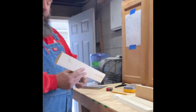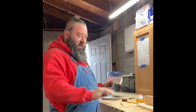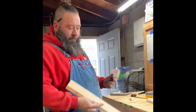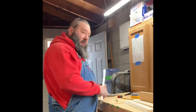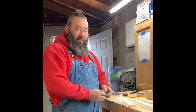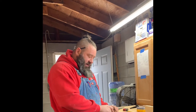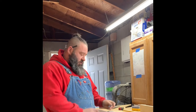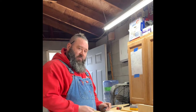Here's what we're going to do: we're going to hang one piece up on the wall like this, and this other piece will actually be mounted to the back of the TV. It'll slide down and fit perfectly. For support, since it's a concrete block wall, we're going to use Tap-Cons — we'll use a hammer drill through the holes. To make everything fit nice and flush, we're going to take it to the drill press and countersink some holes for our screws. We'll transfer these holes to the wall, drill them, mount this piece, and then I'll show you how to mount the other piece on the TV.